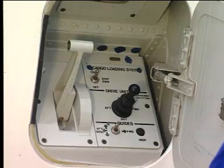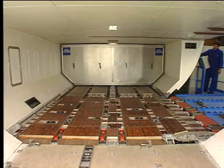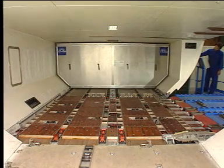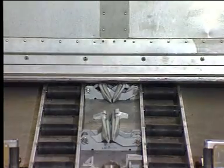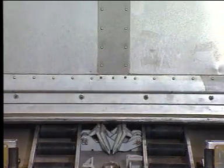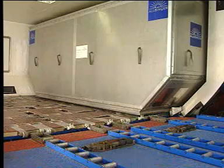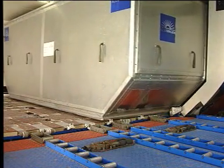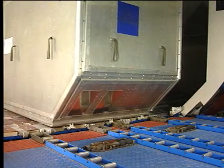Select aft with the joystick. The longitudinal movement starts. For the unloading operation, the electrical Y-guides are overridable and lower when the container is moved. When the container is clear of the electrical Y-guides, the electrical Y-guides rise due to spring load.